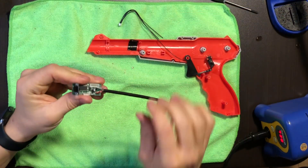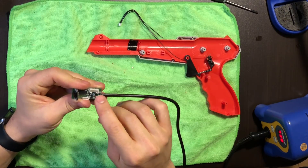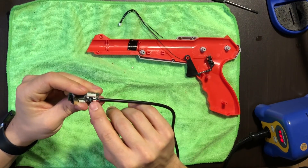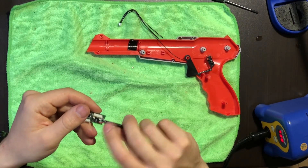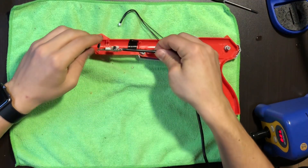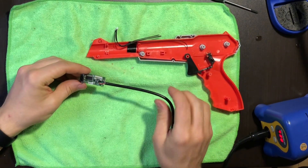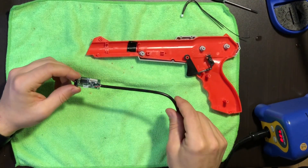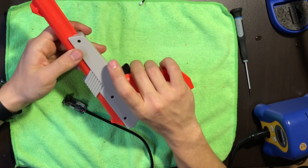When you get done, the red wire goes on the far left, the green wire goes next to it, the black wire goes next to that, and right below the red wire the white wire goes there. The shielded wire I just put in one of the mounting holes for the ground. Everything's hooked up, test fit looks perfect — everything's going to fit in there nicely. The only thing left is to plug this in and hook up the wires to the triggers.